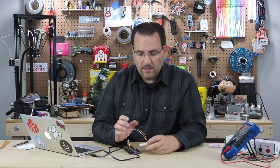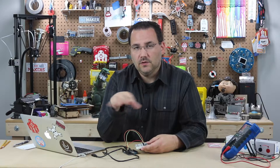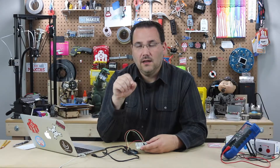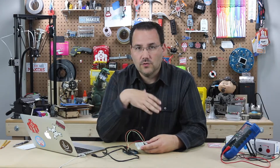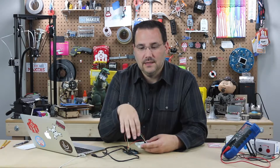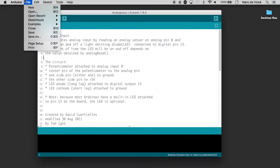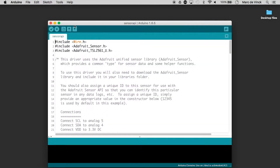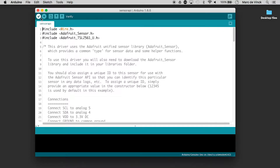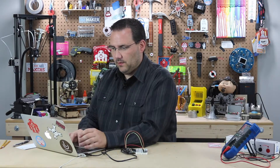While Arduino reloads, let's talk about a few more things. This sensor gives you visible light and infrared light. It's also addressable, so you can use multiple sensors on the same communication chain with just two wires. And there's a gain function — we'll use auto gain, but you can adjust it to change the sensitivity, whether you're in ultra low light or a bright light condition. Now that the library is installed, go to File > Examples, and there's the TSL2561 example. Open that up — it compiled perfectly. Let's connect the Arduino and upload it.